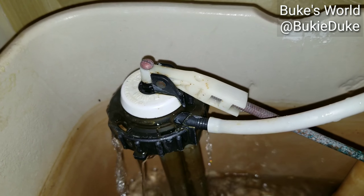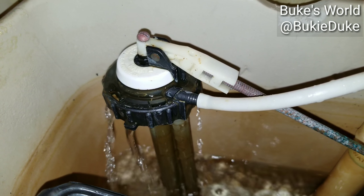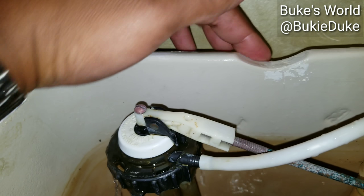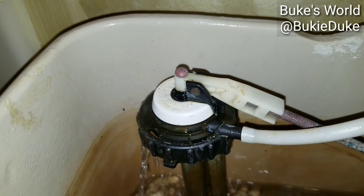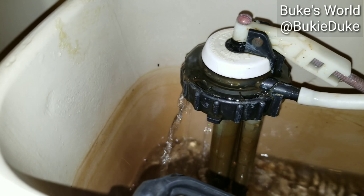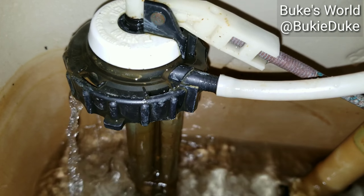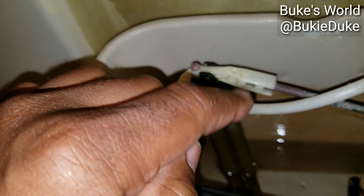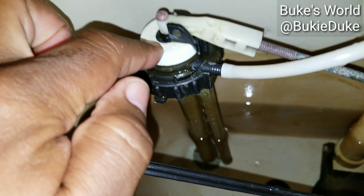Basically what was happening: water was shooting out on the top, then it would overflow, run over from here, leap down the bowl, down the pipe and onto the floor. So we'll turn this off and go to our next step: remove and replace the fill valve.